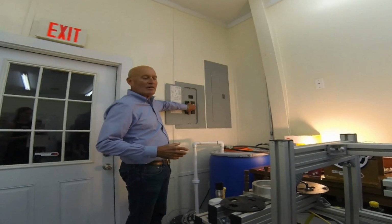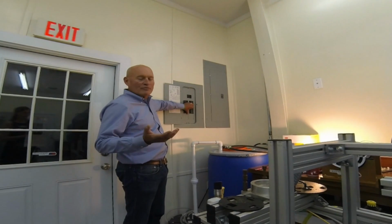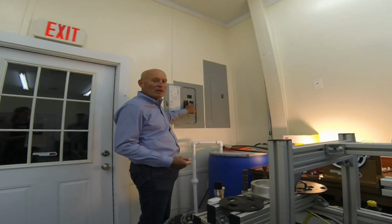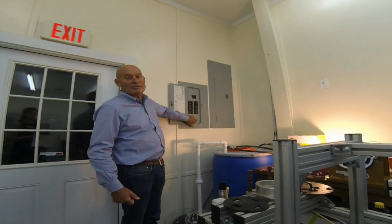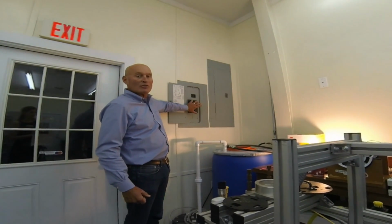There's a calculation called ampacity that your electrical professional can go through, and again, that's covered on the white paper on our website. But what you don't have to be worried about is that, gee, I don't have any breaker space. We do have a couple of spaces here, because you can actually run something called a sub-panel, and I'm going to show you what a sub-panel is in a minute.